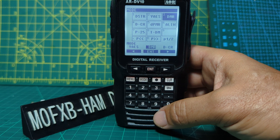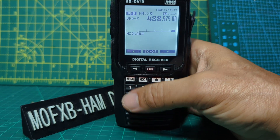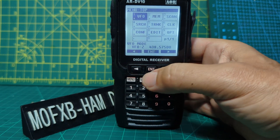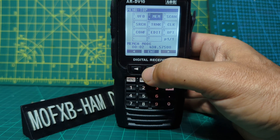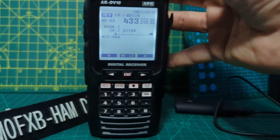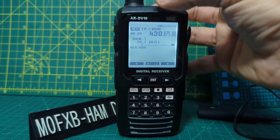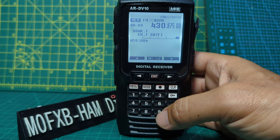I'm going to try it out on HF later on. To come out of that menu, go clear. If we go back in — one more thing about the VFO steps — press menu, enter. Remember, to go into memory mode you would just go across then enter. Those are your memory channels. Always press the execute button at the end and we can turn with the channel knob to select different memories and change frequency when we're in VFO mode.